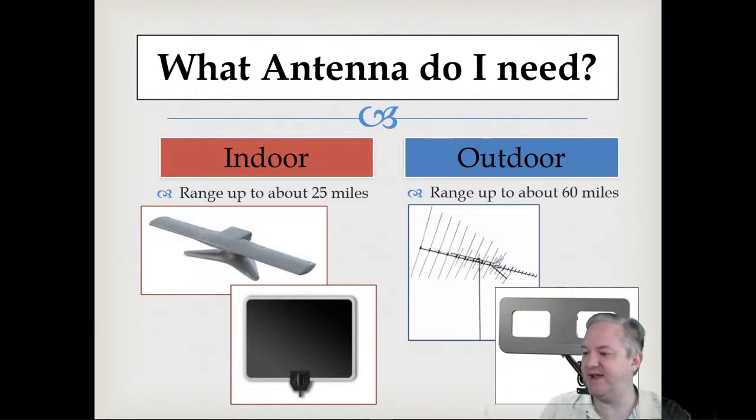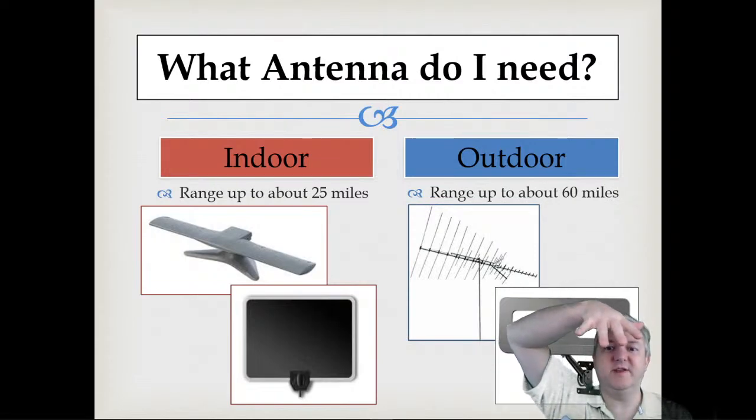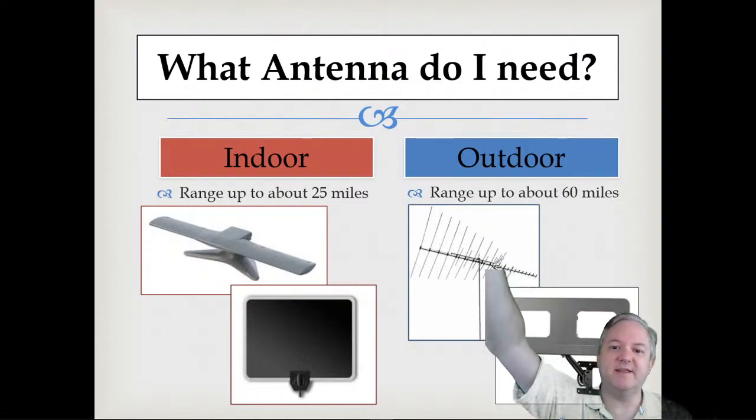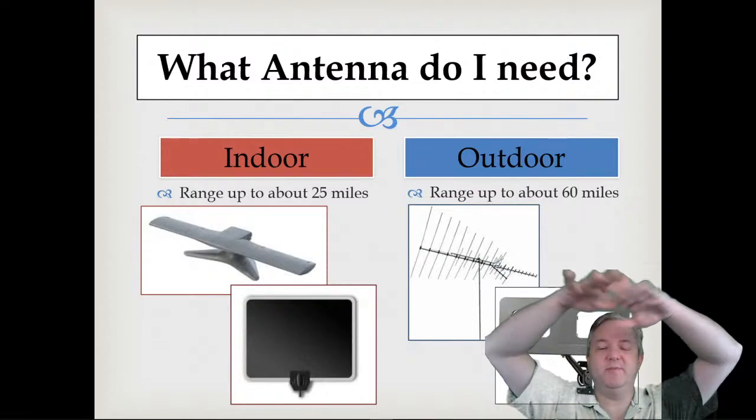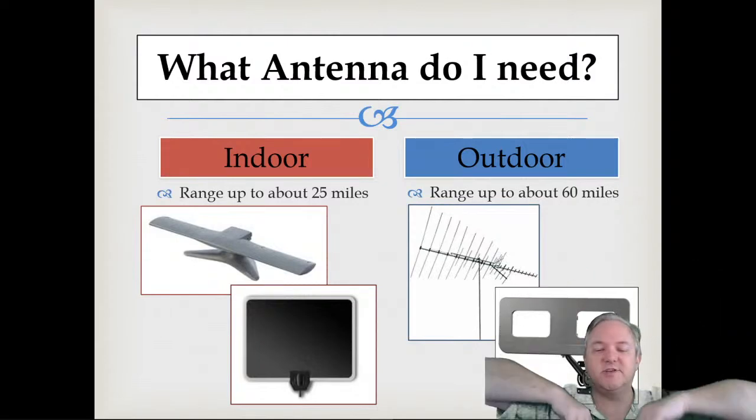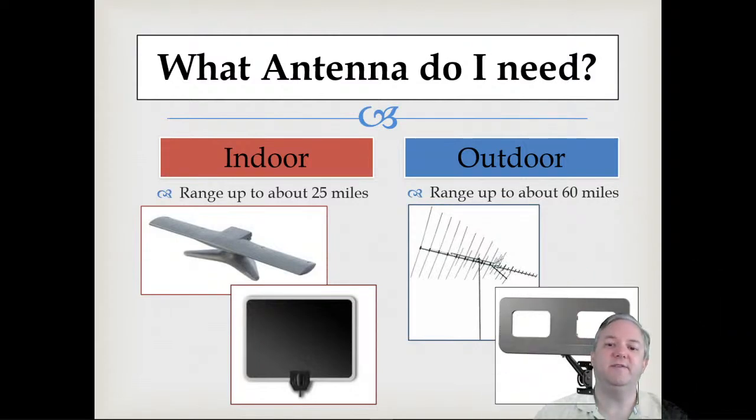It has a little bit of a stand, but mostly it's making sure that there's absolutely no trees around. So if you are trying to set up an antenna outside, and have trees covering over it in any way, try to get those trees out of there, or at least kind of move it in a way that the trees aren't above it, because that could actually stop the signal. What you really want, of course, is a clear sky towards North Augusta for our CSRA area, okay?